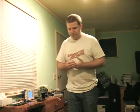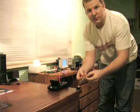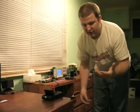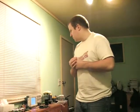We haven't been able to get anything past about 1.5m in terms of accuracy. But sitting on the table here, the way this particular sensor works — like the ultrasonic sensor — you give it power. This particular one takes 5 volts. It actually isn't driven by anything; it's self-driven, all self-contained. All it does is output an analog voltage. At the moment I've got 0.82 volts on the output.